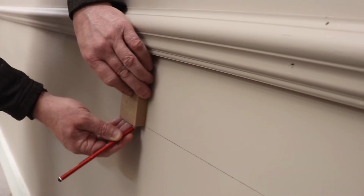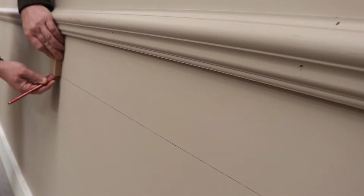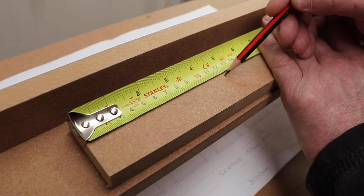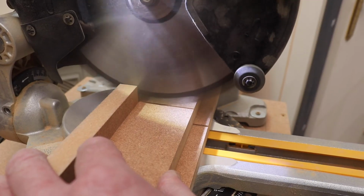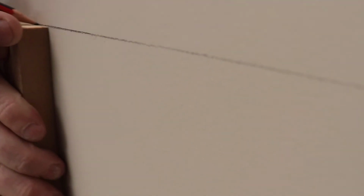There are numerous ways you can draw your panels on the wall, but we're going to use what we believe to be the most cost-effective and simple way for DIYers. We're using a method called staffing. This involves using a piece of material the same size as the parallel gaps so that you know the spacing is consistent and you don't have to keep referring back like you would with a tape measure and pencil. We're using our 120mm staff with some spare MDF, but you can use anything as long as it's the same size as your gaps and is sturdy.